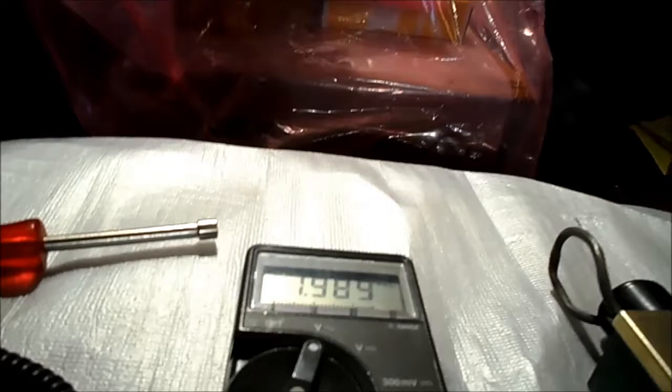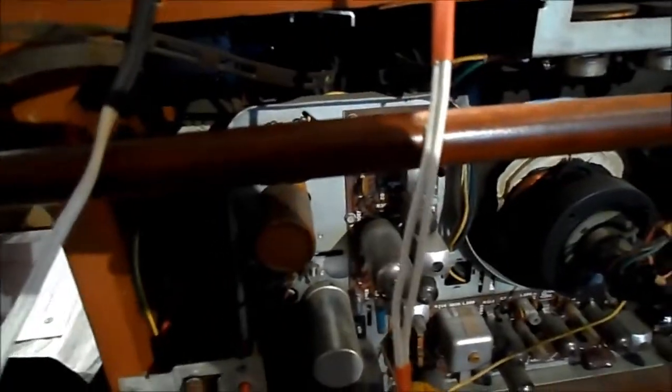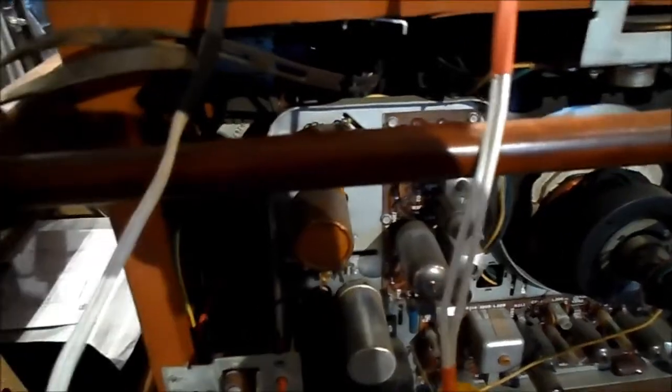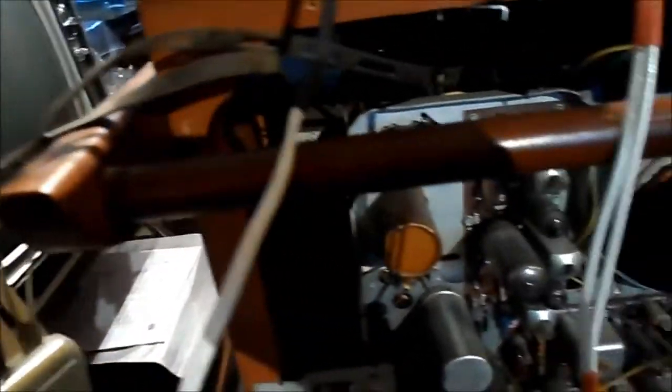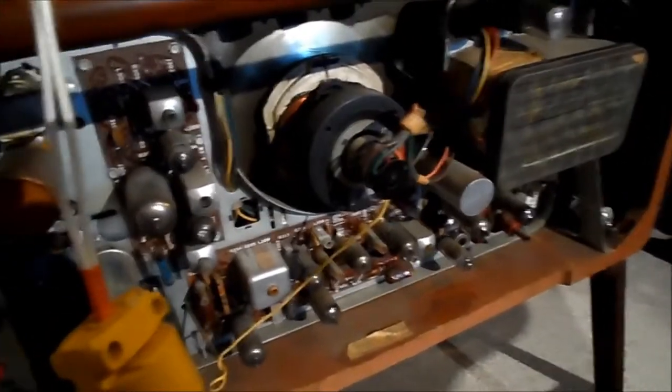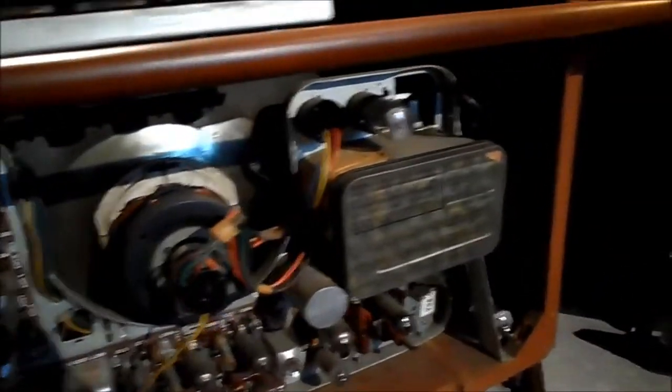On the output I've added a pigtail plug. I may have forgotten - there is a plug on the side of this which I'll use to monitor the AC. This is running about 10 volts higher than what it actually is according to the scale - perhaps we have high line voltage here. In any event, the converter box is on, we have our UHF and VHF attached, and it's a pull-on power switch. We're going to monitor the power and turn the set on without the output tube present.